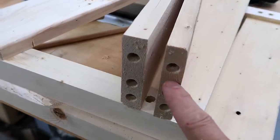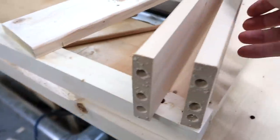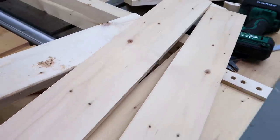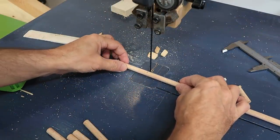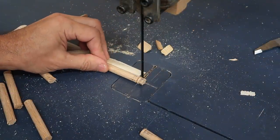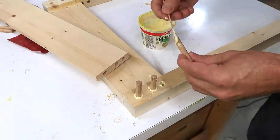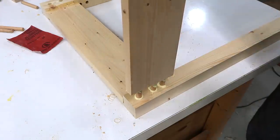You might notice this piece is a bit thinner than the other, at least on one end — I freehand cut it down the middle with a bandsaw and then passed it over the jointer to smooth it. When cutting dowels on the bandsaw it's important to hold them really firmly, otherwise they can kick. And I did that twice. In the end I glued everything on the right way around.